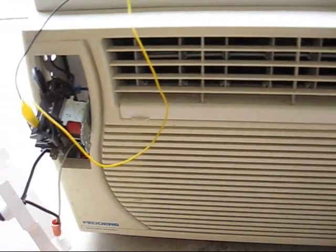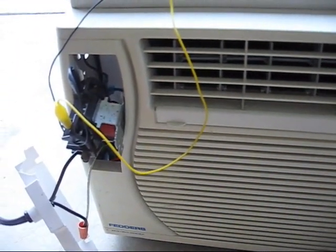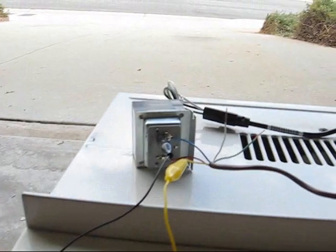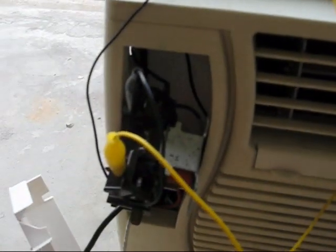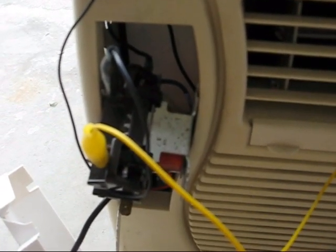It's much quieter than the LG unit that I picked up a few weeks back. I'm working on the low voltage control section for it. There's a 24-volt transformer just sitting on top and some thermostat wire, and just an old air conditioner contactor I had laying around. I wired both the compressor and the high speed fan to be switched on by it.